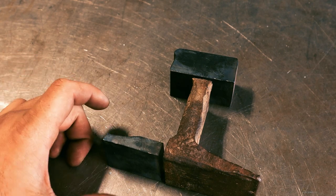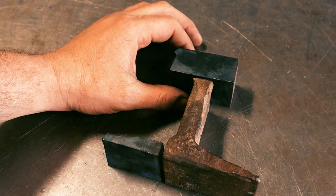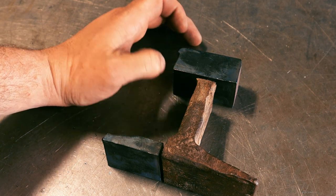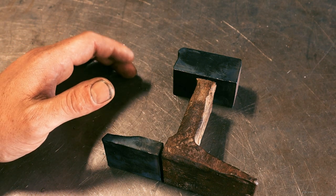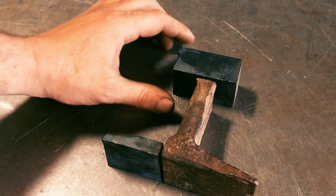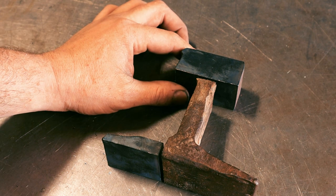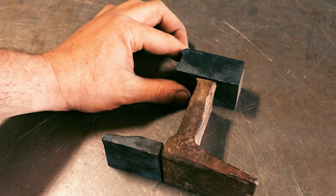While that's in the oven, I wanted to do a couple tests on this railroad track. Based on what I could find on the internet, this is 1080 series steel, 1080, 1084, and according to the Machinery's Handbook, it's used for farm equipment, plows and discs and things like that. Inherently pretty tough stuff. But what I wanna do is figure out, if you didn't have a heat treat oven, what you can expect from this in the way of hardness if you were just using a torch